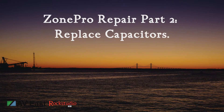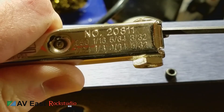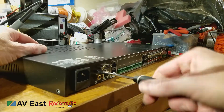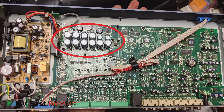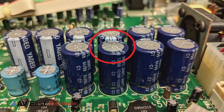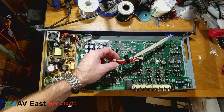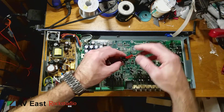To fix the other issues of your ZonePro, we're going to replace the capacitors. First, take out the top set screw using a 3/32nd allen key, then take the four screws out of the sides. There are a couple smaller size Phillips head screws around those RCA jacks and then there's one more over the SPDIF input. Pop the lid off and inspect those large capacitors over by the power supply — those are the ones most likely going to be bulging on the top. Depending on what model ZonePro you have, there may be other capacitors on the board that need to be replaced, so make a note of any that are bulging. Write down the number of microfarads and write down the voltage of them as well.